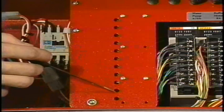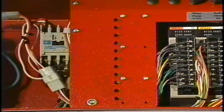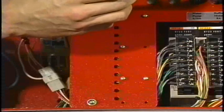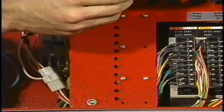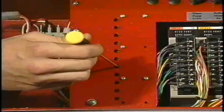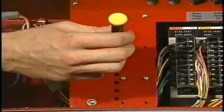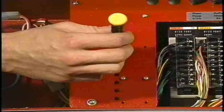The three holes to the right of the seventh speed will be for future trim pots. If we need to increase a drive speed, we will simply turn the screwdriver clockwise. To decrease that drive speed, we will turn counterclockwise. The range pot is the opposite: to increase all the speeds, we will turn counterclockwise, and to decrease all the speeds, we will turn clockwise.